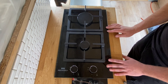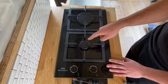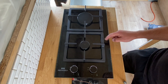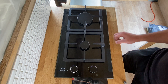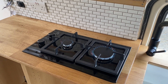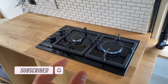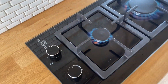Let's check to make sure the safety shut-off valve drops the gas in an emergency. Dropping power to the gas solenoid in the locker — there we go, kills the gas straight away. This hob's also got a built-in flame failure device so that if it detects the flame's gone out it shuts the gas off — you can't leave the gas on accidentally. That's the flame failure device in action. So that's our hob installed. I hope you found this video useful — if you did, please give it a thumbs up, consider subscribing, and click the bell for notifications. Hopefully I'll see you next time. Cheers guys, take care.